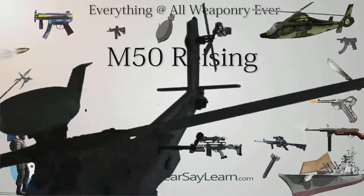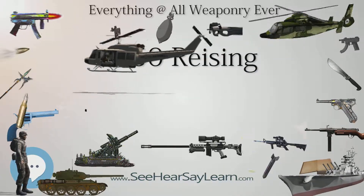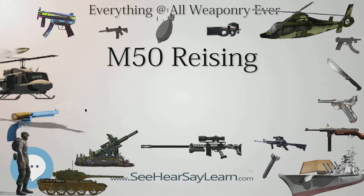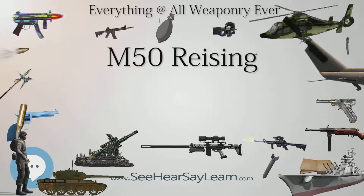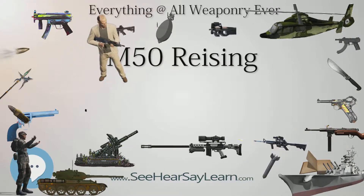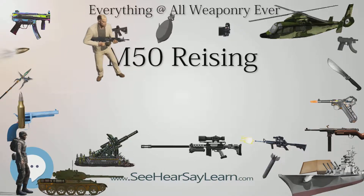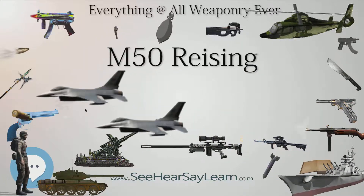What constitutes a commercial and military Model 50 is amorphous — H&R never made a distinction; the distinction is made by collectors. This confusion stems from early Model 50s manufactured with commercial characteristics and H&R's wartime practice of randomly installing old parts in stock throughout production. While there is not one factor that distinguishes the so-called commercial from the military model, the commercial model is usually blued. It commonly has a fixed front sight and a rear sight with no retaining screw. It often has 28 fins on the barrel, a one-piece magazine release, no outward flanges on the safety/selector switch, and no sling swivels. The commercial model commonly has a smooth takedown screw, a two-hole trigger guard, and serial numbers ranging from 1 to 20,000.